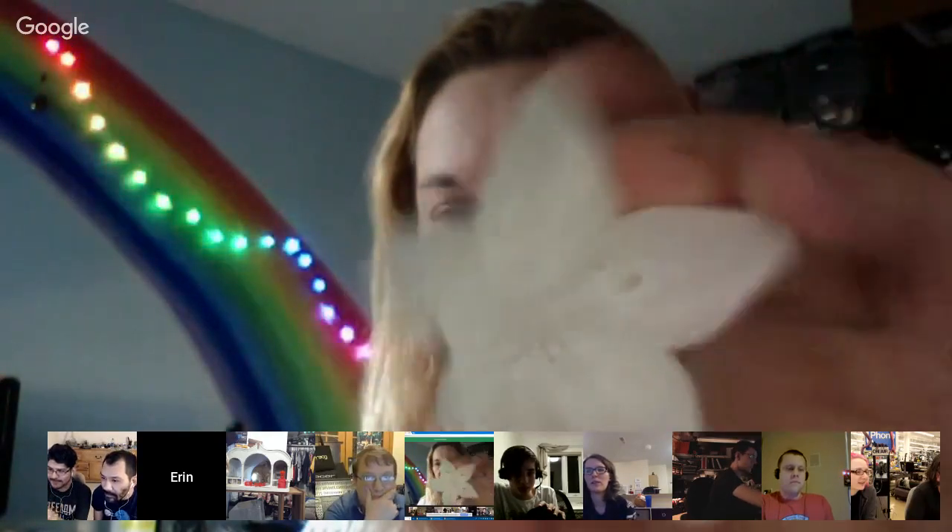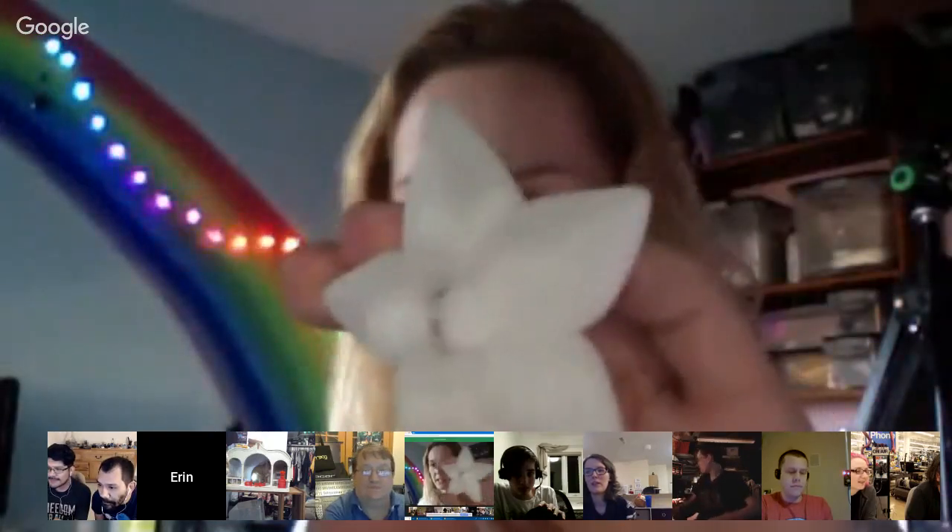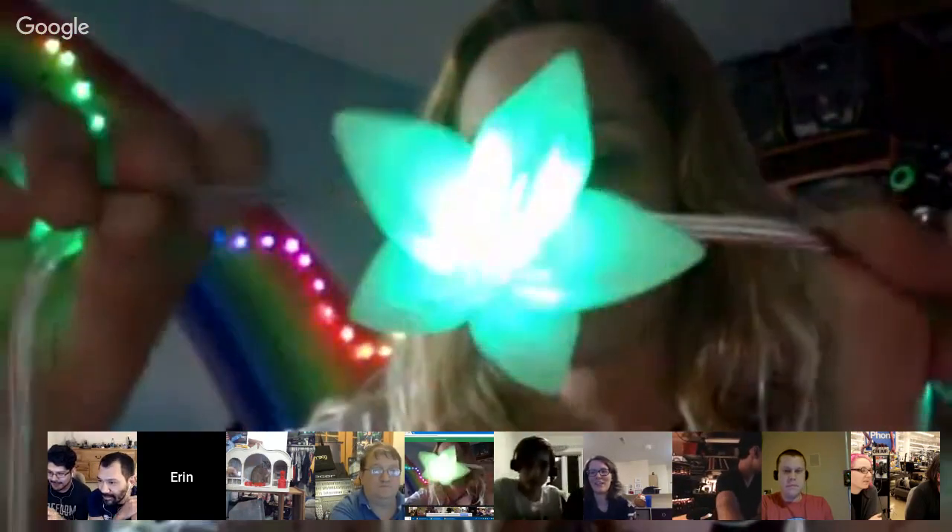Next up, Erin. I'm here to show off my new 3D-printed light strand. You can see the whole thing on the wall behind me doing a rainbow, which is fun. I modeled basically an Adafruit star-flower kind of star in my 3D printer with Fusion 360, and I put these clips on the back that just clip perfectly onto this NeoPixel strand — a 4-inch pitch NeoPixel strand. You just pop it on there and the whole flower glows. It's really pretty. I'm using a Circuit Playground to run it, and did the programming in MakeCode, which is fun because I've got the light sensor set up. I can shine a flashlight at the Circuit Playground and the light actually goes off — so it's light sensitive. If you have it out in your yard during the daytime the lights will be off, but as soon as it gets dark they'll come on automatically. The guide will be up probably later this week or next week.